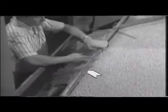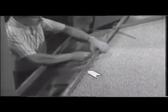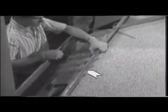These gates on the high side of the machine can be opened. This will let the heavy product flow off the deck quickly. One word of caution: open only a couple of gates at one time. Increase the feed a little and allow the operation of the machine to settle down. If necessary, adjust the air a little and then open until all gates are open.